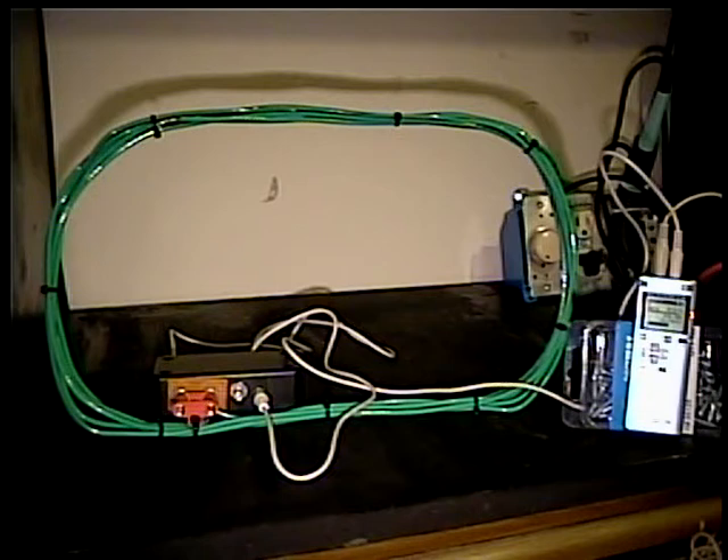I've got quite a bit of RF bypassing inside because I recently started using 25-foot 3.5mm to 3.5mm audio cables to reach from the kitchen table to the computer. I was having a lot of AM radio station RF pickup, so I did add some capacitors to the original circuit and now have a pretty high level of RF immunity. I'll be showing those updates pretty soon.